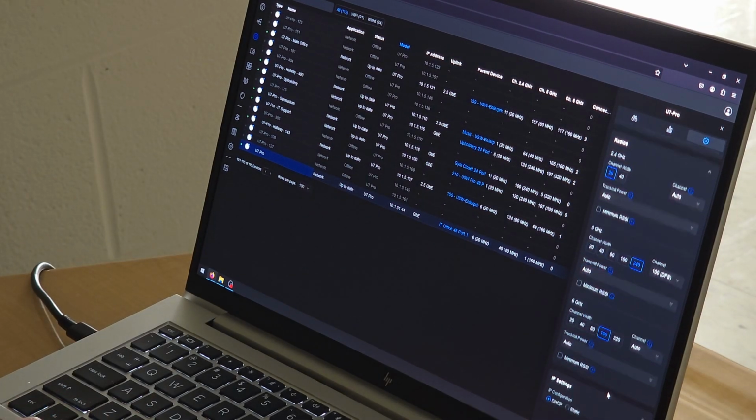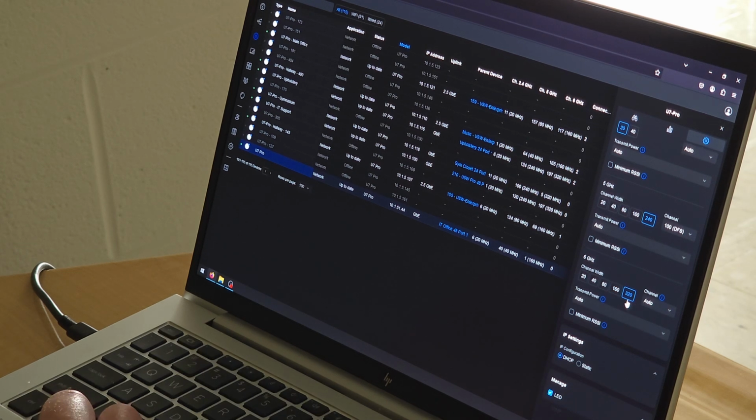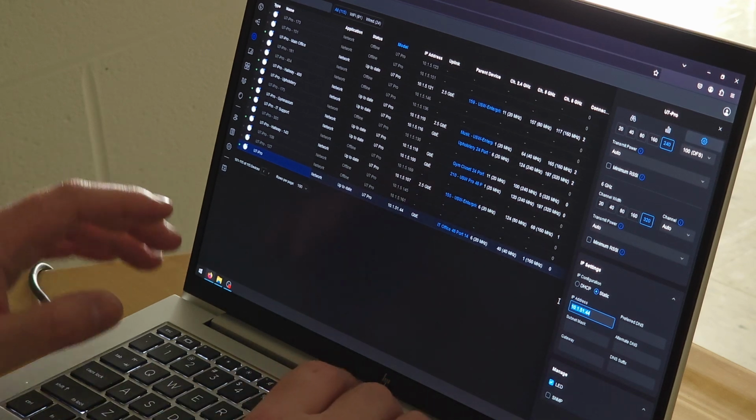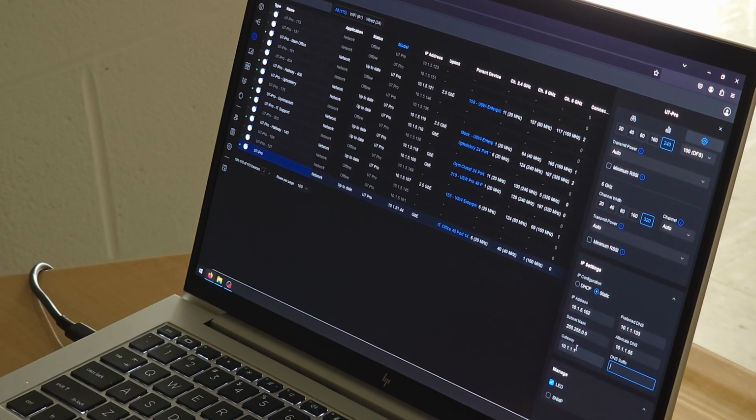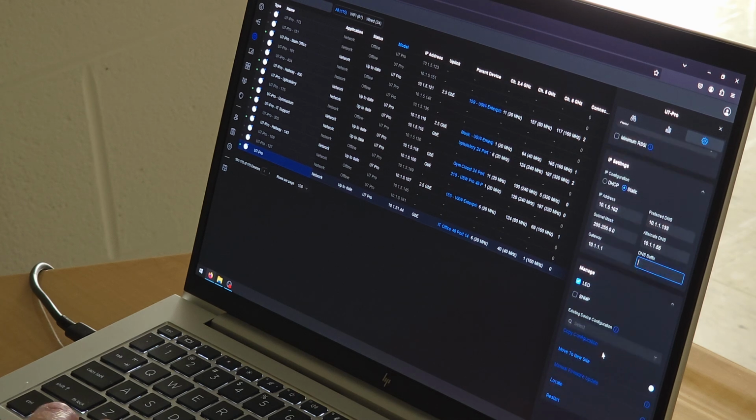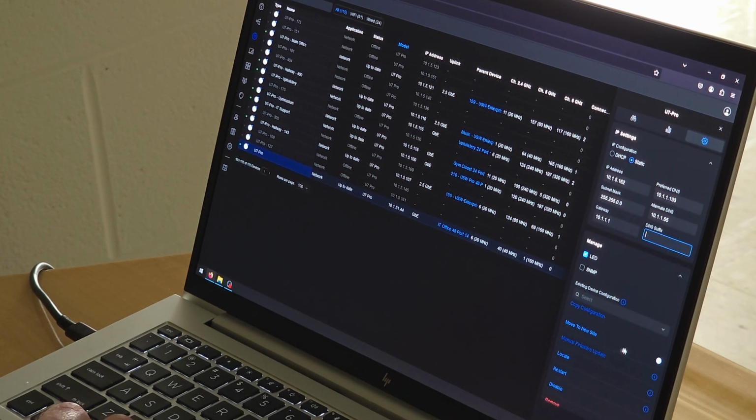And of course, the 6 gigahertz range has 320 channel width there for you, and you have a lot to select from. Let's say we want to set the IP address manually. We can do that here. We can manage SNMP, or we can turn on and off the LED, move it to a new site, like migrate, and we can remove it from our adopter.